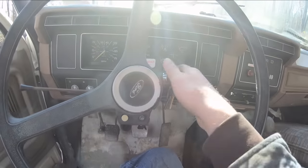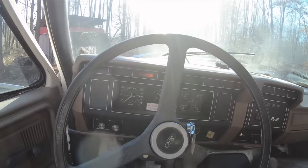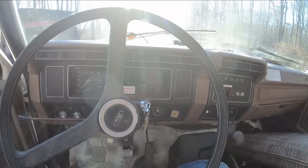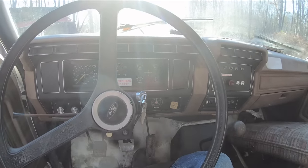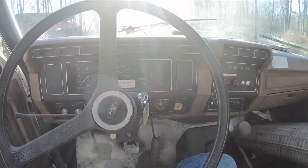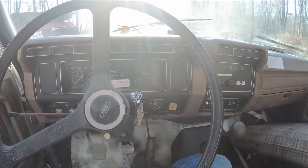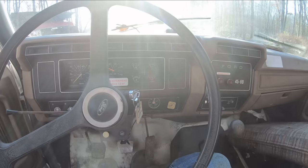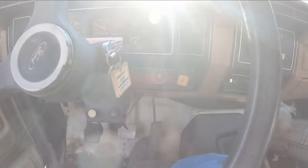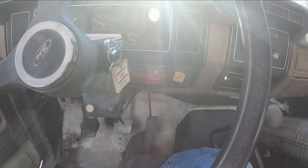Okay, let's go ahead and get this thing fired back up. That squeal's getting pretty annoying. I really don't understand why it's squealing. I even put belt dressing on it already. It's the alternator belt, and the alternator spins over fine and is charging. I don't know. Doesn't feel like it has any bad bearings or anything. Maybe I'll just replace the belt. Anywho,